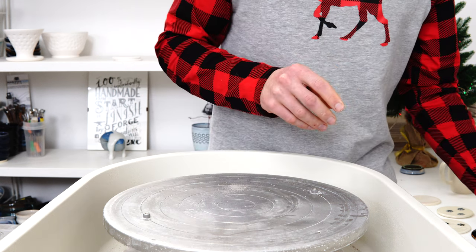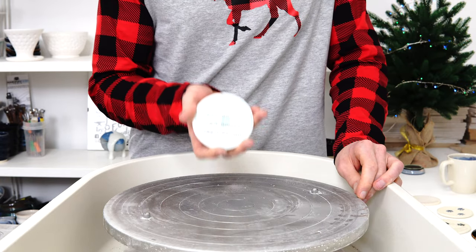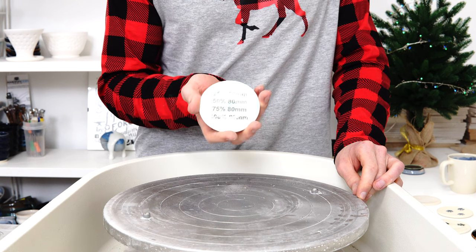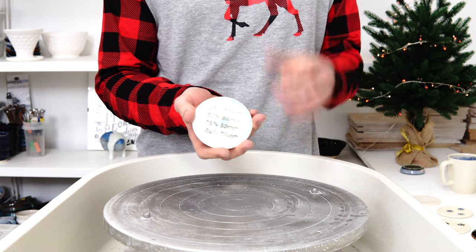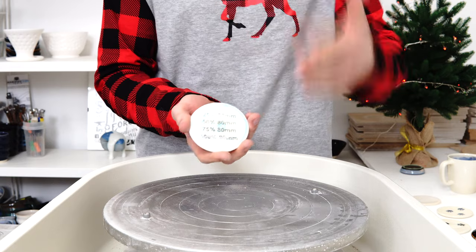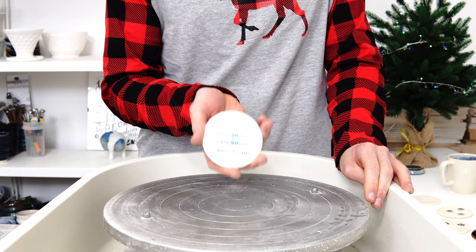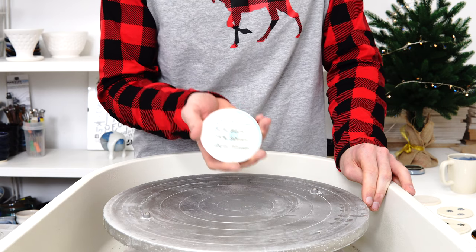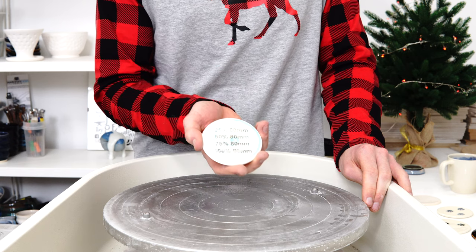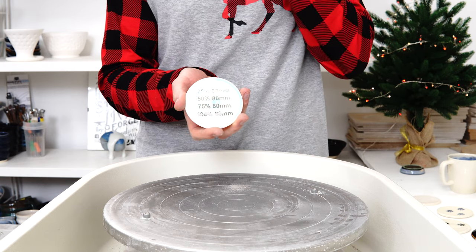My current thoughts: I've tried a couple of different wax resists and settings and I'm not sure the wax is fully leaving. A few options - I could do multiple passes to burn it off repeatedly, I could try colouring the wax with more pigment so it absorbs the laser better. This one with a bit more colour does seem to absorb it better, but they all react to it.